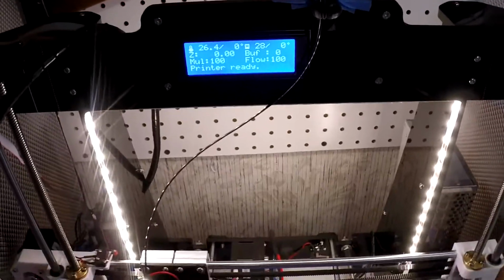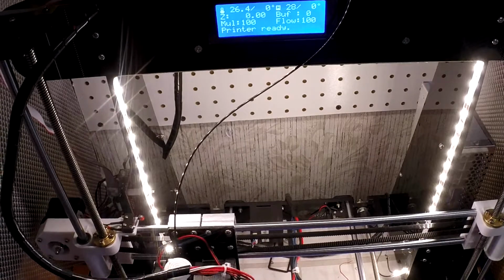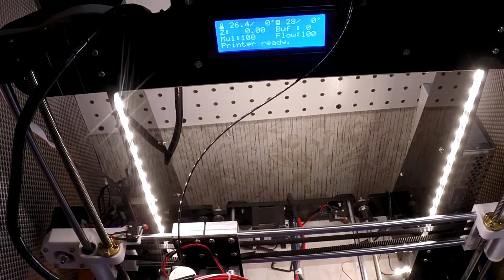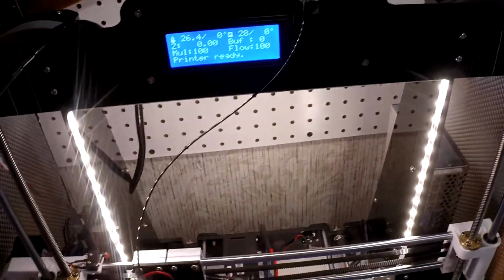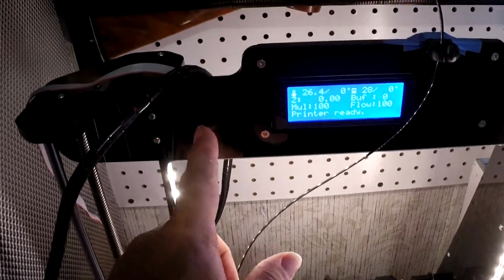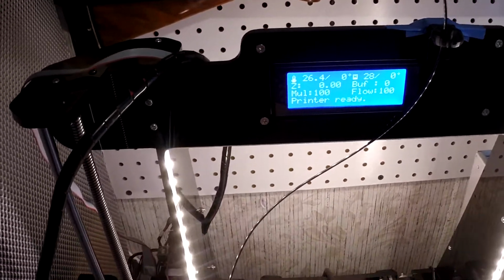It takes a little bit of your time. Probably twice a month I go through and give all my screws a turn and make sure everything's tight. Because if you put Loctite on these, the Loctite will eat the acrylic and it will cause the seams to split apart. You don't want to do that.